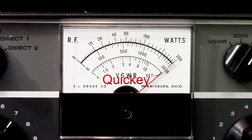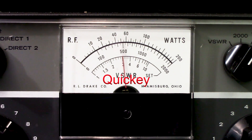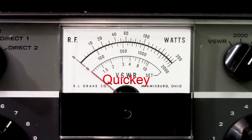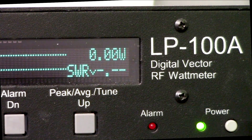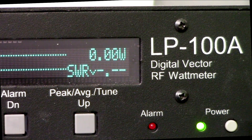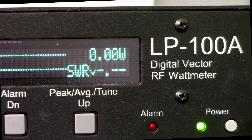So there's 190 to 205 watts or so. Put it into the DIT position and it's showing about 52 watts. So that would be a ratio of about four to one. I'll confirm that with an LP-100 wattmeter that's peak reading — it's very accurate. That's close enough: 204 watts. So the ratio is almost exactly four to one with a heavily damped Drake wattmeter.